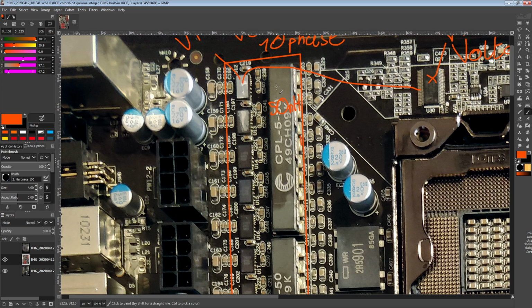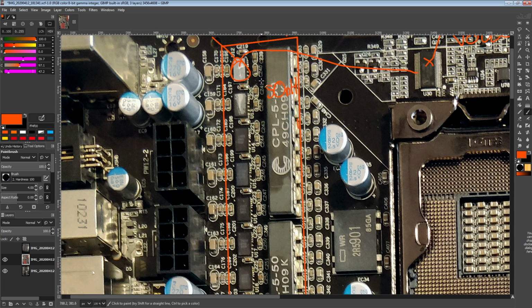So yeah, anyway, there's an open circuit inductance rating in the data sheet, and that is much, much higher than the effective inductance of the whole coupled inductor, which I assume is down to the fact that when you turn on phase 1, it induces a current through phases 2, 3, 4, and 5. And the same goes if you turn on phase 3, it induces a current in 1, 2, 4, and 5, because 3 obviously is increasing current because it's turned on. Because of that induced current in the other phases, the effective inductance is really, really low, which means great transient response. And you also get an efficiency improvement relative to how low the inductance is.